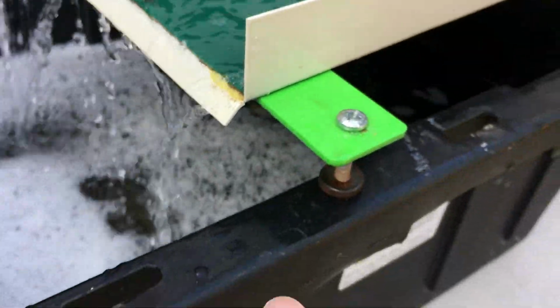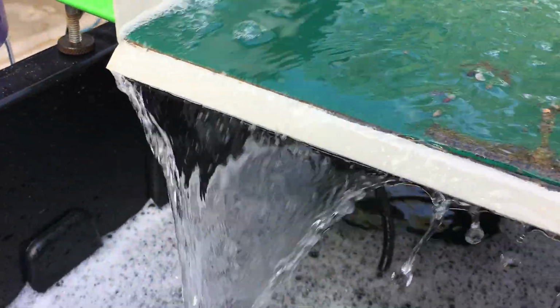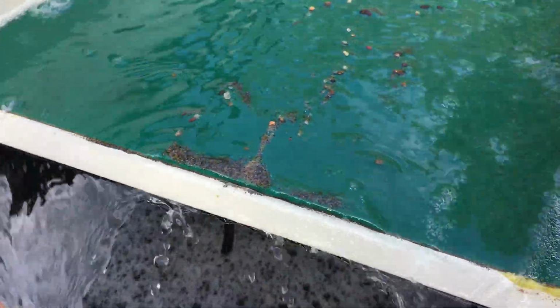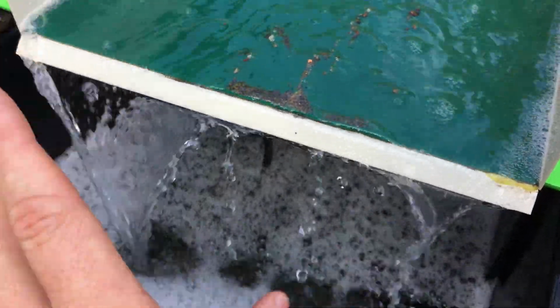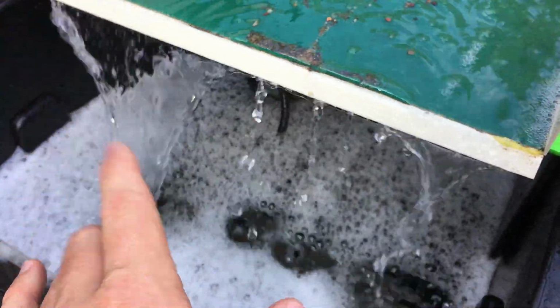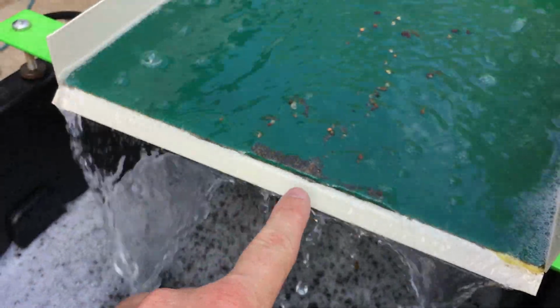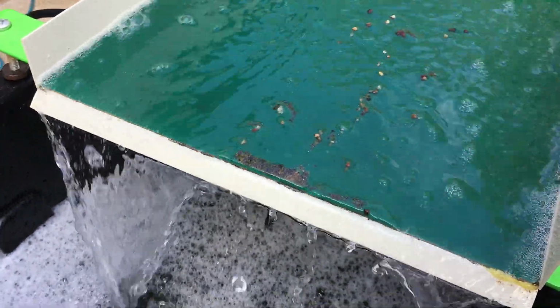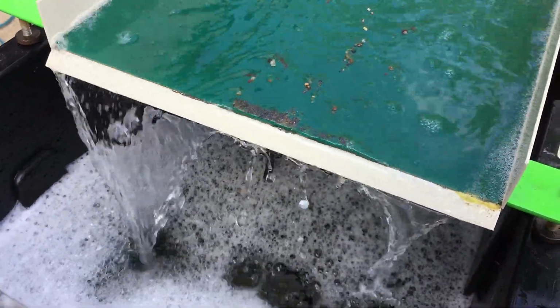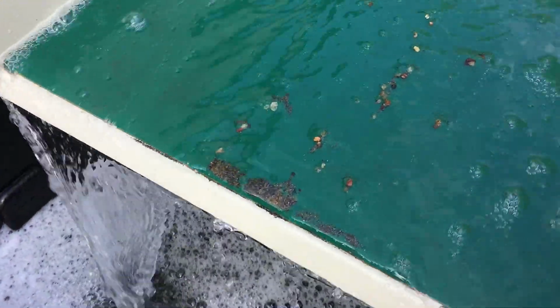And you change the angles by these little doodads right here. We kind of figured out that it's like a sluice box. You want to have a V going in on a sluice box. Well, on this you want to have a V coming out, where it comes down to one little point like this. But we think we got a high spot in the table here, so it's not doing what it ought to. But we do have it adjusted so the material is not running off to the left or running off to the right. It is coming straight down the middle, and we can work it.